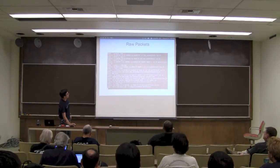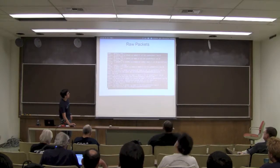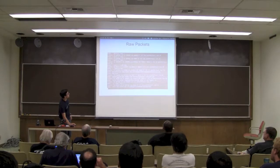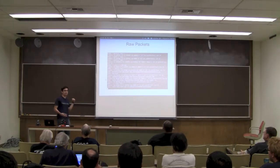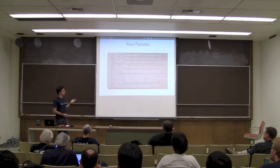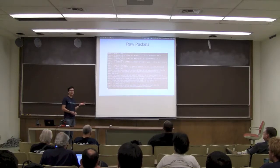There's a special way that APRS positions are reported, which is kind of funky, because I think this character in between the latitude and longitude is actually part of the icon, and so is this. So it's a really ad hoc format that kind of evolved and was appended to, given the limitations of how much space they have. To give you an idea of how fast packet radio is, it's 1200 bps, 1.2 kilobits per second.